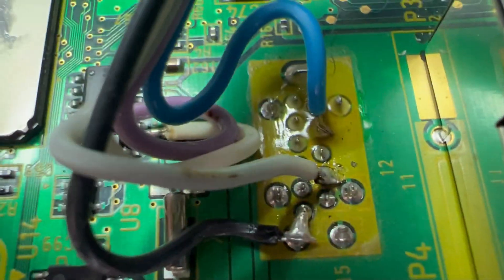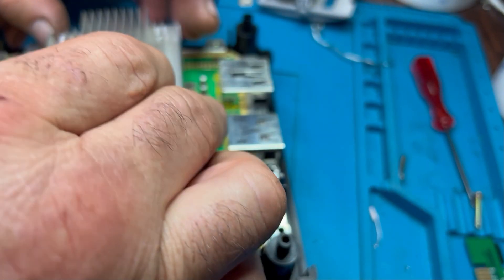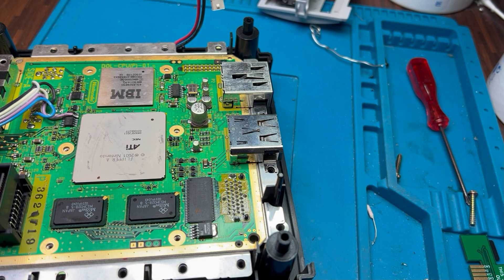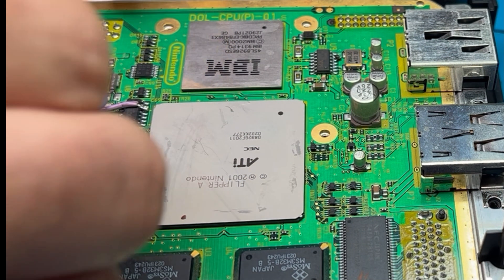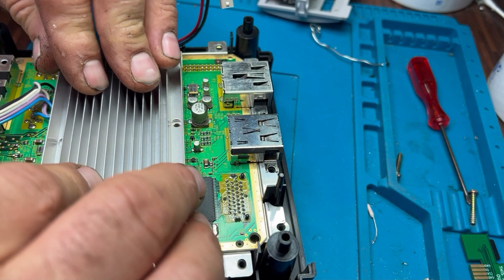I had some boot issues with this install, to be honest — I've since removed those wires and gone with a smaller gauge copper core install. It did boot, but occasionally it just didn't boot correctly. After some googling I realized the wires were a little too long and I should have used copper core. The heat sink came off fine with no damaged pads. If you're too rough or try to pull the heat sink straight up, it tends to tear and can't be reused. I used a little kapton tape, worried the thick wire might short on the underside of the aluminum heat sink.